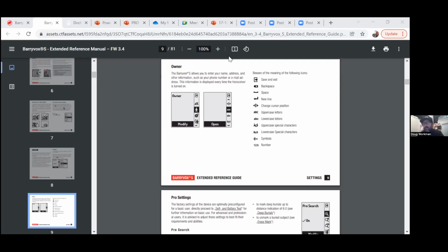So all beacons, regardless of manufacturer, that have a marking function are going to generally lock on. That's because what we're trying to avoid is that switching back and forth of, like, back in the day, using a beacon that didn't have marking and it was just constantly flip-flopping. So it's important to remember that that locking is intentional. But of course, that locking comes with drawbacks.